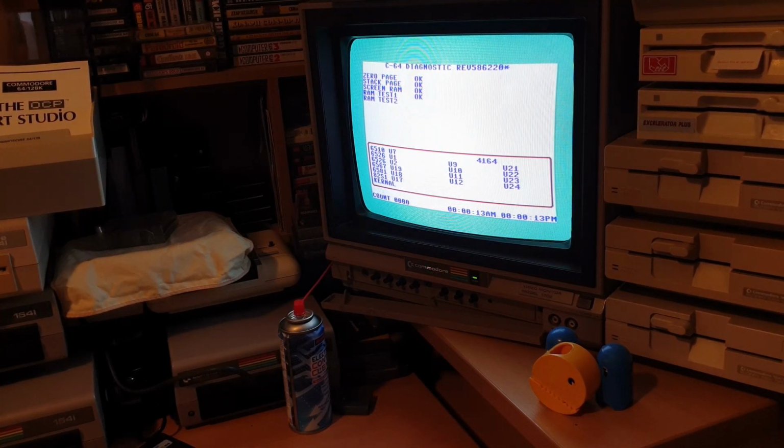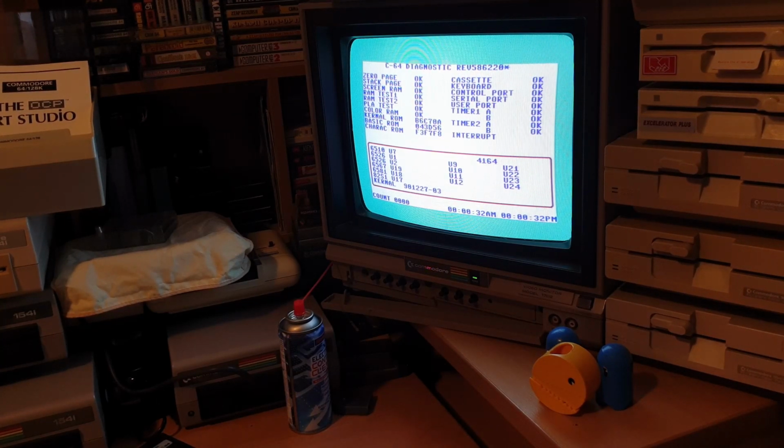So what I might do in a minute is take the two CIA chips out, what they took out of the board over there, clean the pins up, pull one of them CIAs out and put the chip back in, and run the test harness again, and let's find out which CIA chip is actually faulty. Then at least we've got one spare, and I don't have to charge Tony for two. I think Tony would prefer a bit of charging for one rather than two.